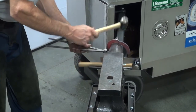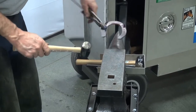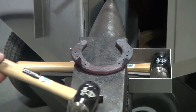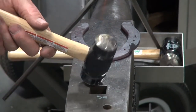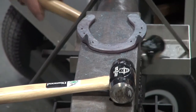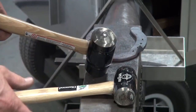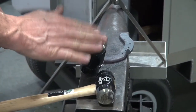Put the clip at the angle of the hoof wall, and there we have quarter clips. I've used this hammer — the 24 ounce — because it has a smaller radius on the rounding side. If I were to use the 36 ounce hammer for drawing clips, I would end up with a very wide clip. That's going to work a lot better for you when you're drawing clips.